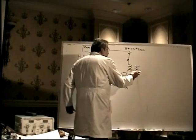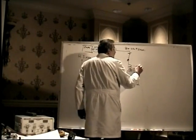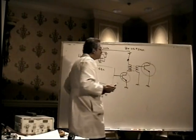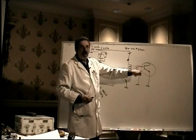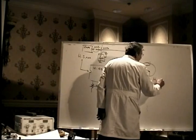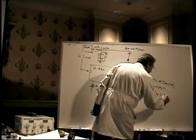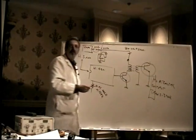That having been said then, this transformer is a step-down transformer that steps the voltage down to about a volt, just 1 volt here. And the reason it's only 1 volt or so is that this transistor, this output is going to be driving the big wazoo, the hardest working transistor in showbiz, which only takes 0.7 of a volt to turn it on. This guy right here, the horizontal output transistor, referred to by some people as the HOT.